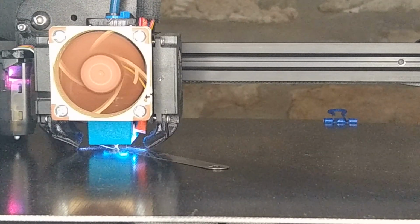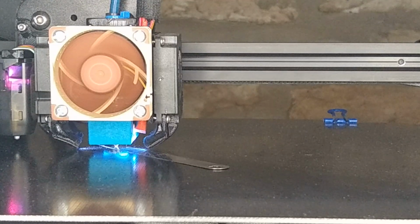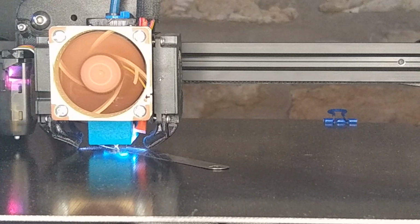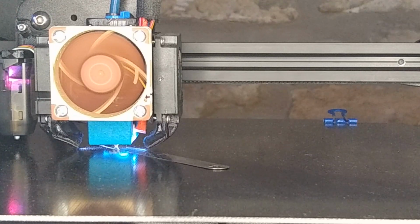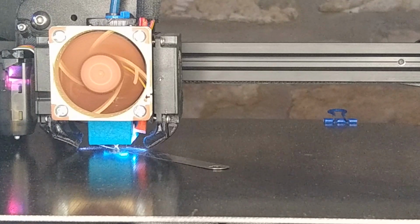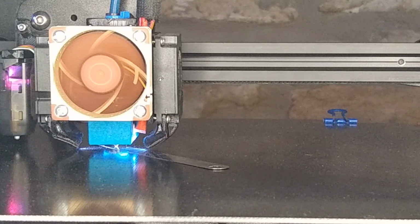But what you can do is, if let's say I would have dropped it down and it would have been pinching that feeler gauge, then what you can do is test Z space Z equals, and then put a plus and no value after the plus and press enter. And what it'll do is it'll raise it half the amount that it just finished lowering. So that's kind of cool to hone in on that sweet spot. And it's a good tip to remember.